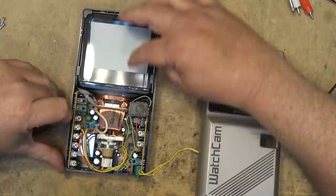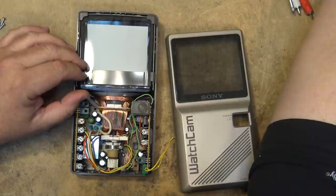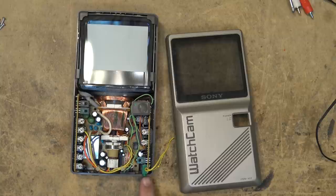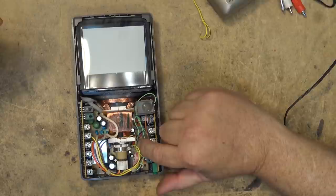Here's the inside of the unit — here's the flat CRT. I'm going to take out the audio board here and disconnect the speakers. It even has an earphone socket — like a headphone jack — as if you're going to plug headphones in. I guess if this was being used for surveillance and the camera was hidden, somebody watching it could listen in with headphones instead of having the speaker on. There has been a little mod done to this unit — that green wire wrapped around here.